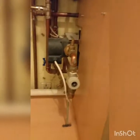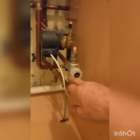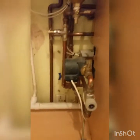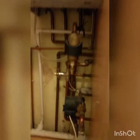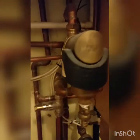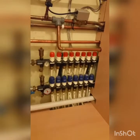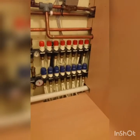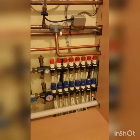Try to use standard components. If you must fit an on/off system, just use a standard manifold and standard pump - you don't need any special pumps. Don't forget to do your hydraulic separation if it's needed. On this one we don't have hydraulic separation, but given the number of underfloor loops it probably wouldn't have been a bad idea.